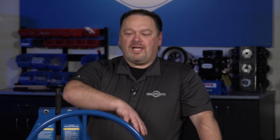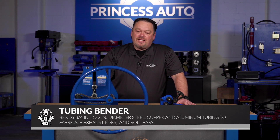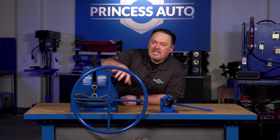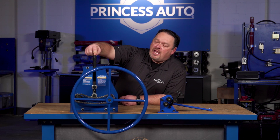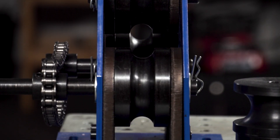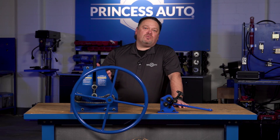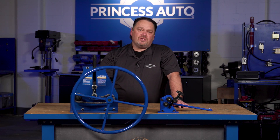As you get into the larger tubing going from the rings, we've got manual tube benders as well as pneumatic or large hydraulic press tube benders. This unit in front of us is a manual operated tube bender. You have a nice big wheel for mechanical advantage rolling that tube through the center of the unit. Inside the center, you've got a series of dies — two fixed dies and a die attached to a threaded post. As you twist and turn, you start to create more downward tension on your tubing as you run your wheel, and you'll start to bend the radius into your tube. This unit comes with a variety of other dies, so it's not just one size of tube. On the backside, there are cotter pins you just pull out and the dies come out easily. Put in new dies and away you go.